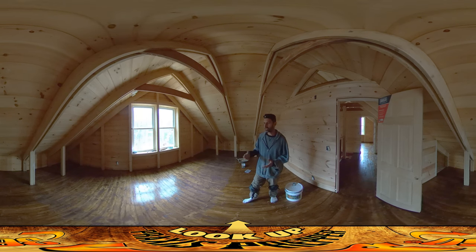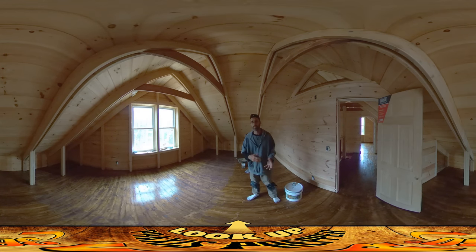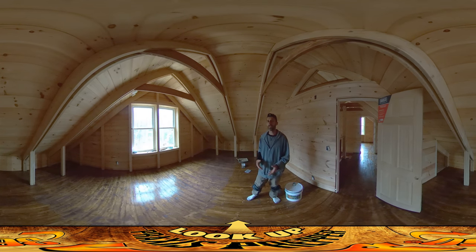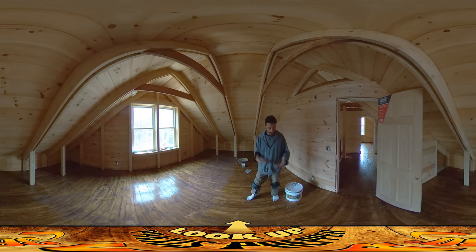That made me a little concerned because the seal I'm using - this one right here - is made by Eco Pro Coat, their eco poly sealer and finish. I chose it for health reasons. I was looking into a lot of the oil-based seals and I didn't feel comfortable with them - parts are going to get scuffed up into dust, people will breathe that in, some were even advertising aluminum compounds to make them harder. I don't want to be breathing aluminum, and this is River's bedroom - I certainly don't want him breathing aluminum particles. But I was concerned about the saying about oil and water and whether there'd be a problem putting a water-based seal over an oil-based stain that hasn't totally absorbed into the wood.